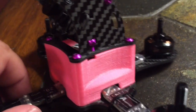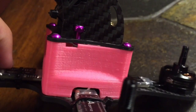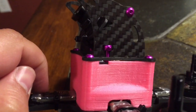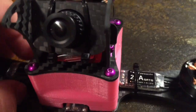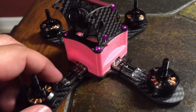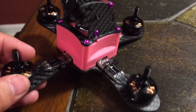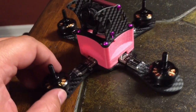The only snafu I can see is right here — I made a clearance cutout for the head of the screw, but I must have taken the measurement wrong because the edge is centered on the screw and not really clearing it, so it's pushing out just a little bit there. I'll go back, redesign it, reprint it, and it should work fine after that. Other than that it looks like it's going to work well and keep all the electronics enclosed in the Mitsuko. That's pretty much my design for the shroud, and I'll probably put this on Thingiverse so other people can print it out and use it on their Mitsuko.